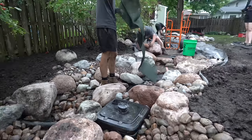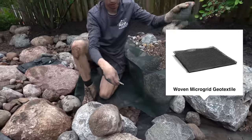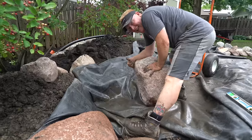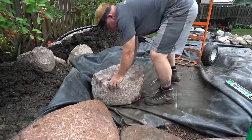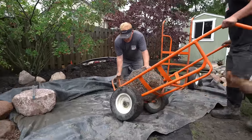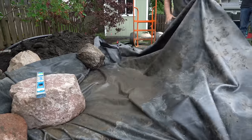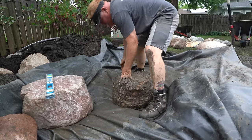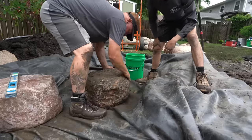Jack is taking geogrid and putting it over the top of the AquaBlocks to ensure that small gravel doesn't fall through the cracks. As he works on that, I continue bringing in boulders — setting key focal point boulders first, then rocks that frame out waterfalls. In this case, she wanted a couple boulders as stepping stones to get from one side of the stream to the other, since her dogs love running up and down the fence. I'm setting that middle stepping stone — if it doesn't sit just right, we use gravel to level it off.